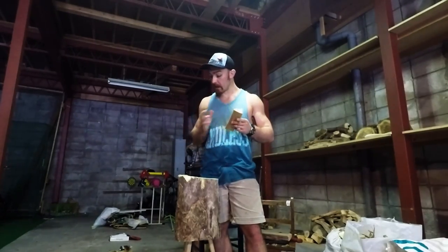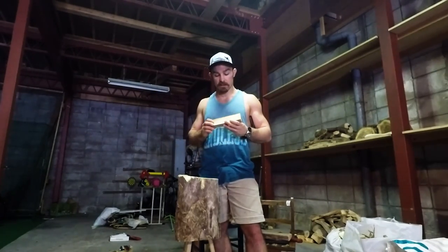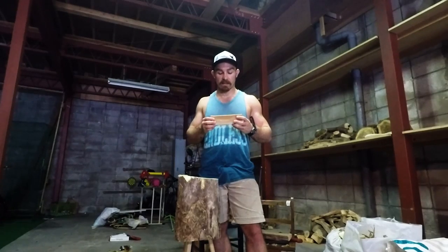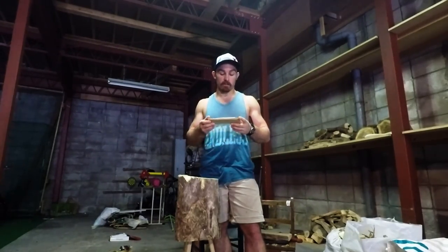I was very lucky - I had some spalting occurrence in this piece of pear and it hasn't gone too far. You can notice when chopping down the pieces that it's not behaving like regular wood anymore - not falling off in big chunks or feathers but breaking away like rock. That's a sign I was just in time; a little longer and it would have gone bad. So I chuck the billets into the bucket of water, turn them around every day if they're sticking out, and see how long it takes - sometimes two days for a smaller diameter, sometimes a week.